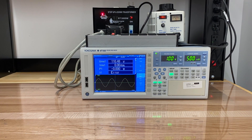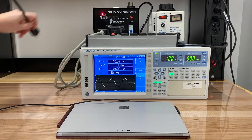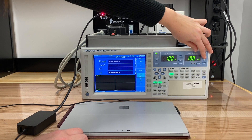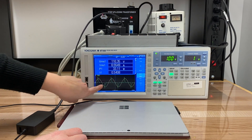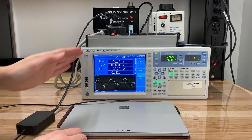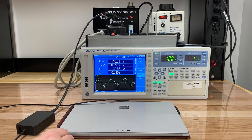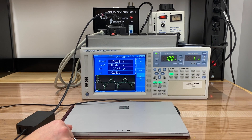The last thing we're going to look at is trying to charge my tablet, which is low on battery right now. This tablet charger is rated for 44 watts. If we plug it in and zoom out a little bit, we see very similar current characteristics to what we saw with the CCFL. Every half cycle, there's a point at which the line voltage reaches a point where it's a little bit higher than the bus voltage, and we get an inrush of current, just like the full bridge rectifier we saw in the CCFL. Here we've got a power factor of about 0.54, but we're pulling a little more than 30 watts. So you might imagine, if we've got all these different loads doing this on the grid, it's probably not a very good thing for the grid's power quality.